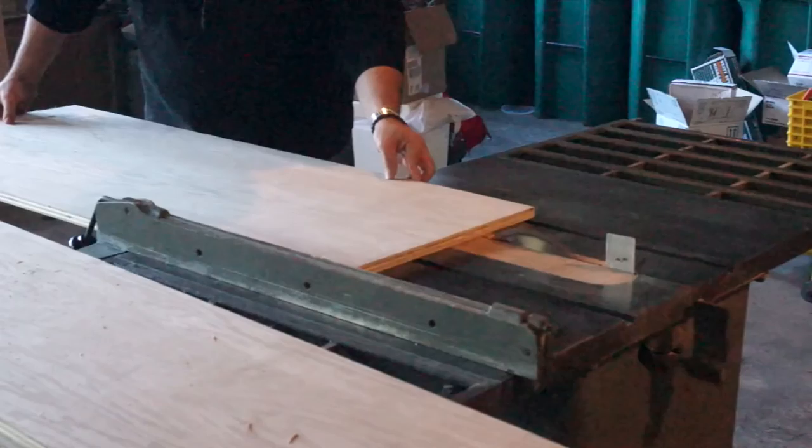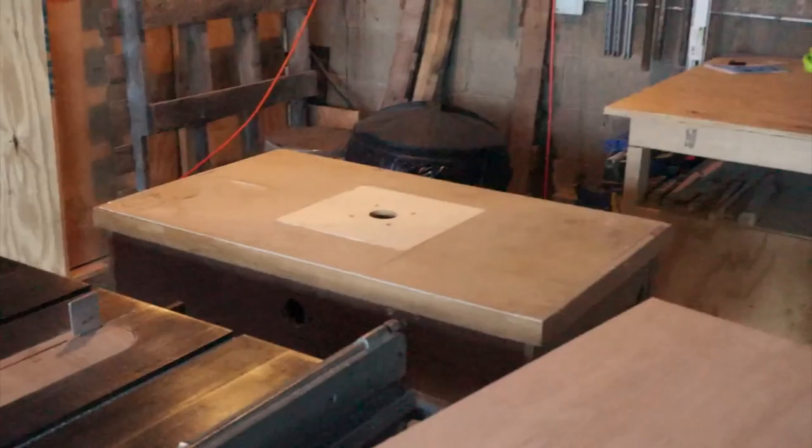The first thing I need to do is break down the oak plywood. One of the things I learned a long time ago when doing a build is to label all the parts. You can do it in pencil, but I personally prefer to do it with chalk. Chalk comes off rather easy — you don't have to worry about the grooves that a lead pencil would leave.